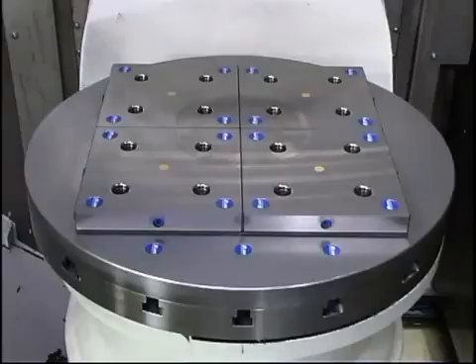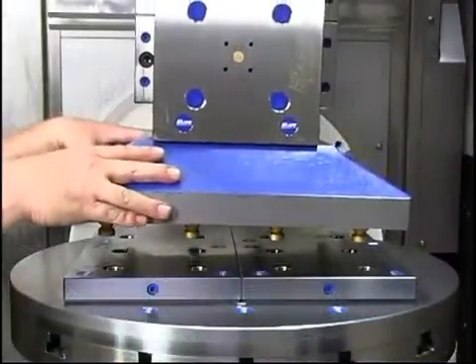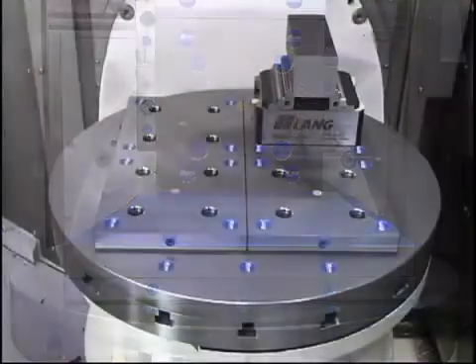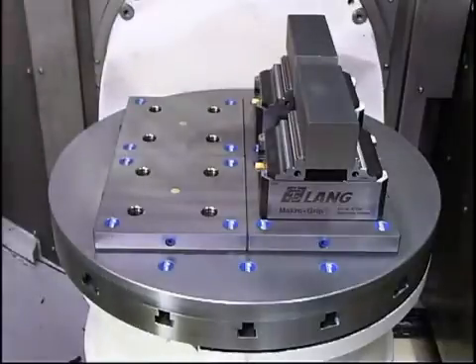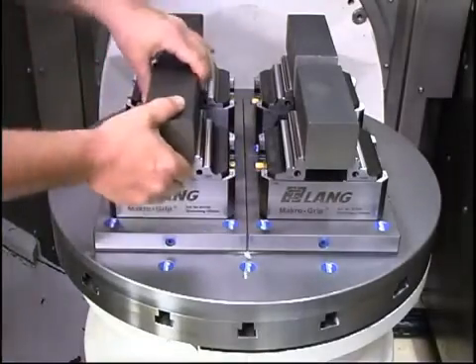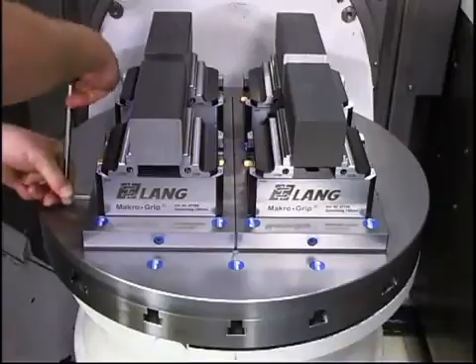By using multiple raster plates in different mounting patterns, this system allows large fixtures to be positioned and clamped without problems. The placement of multiple raster plates on the machine table also allows the highest flexibility in positioning of fixtures at various locations on this grid. The raster plates have no standard mounting bores, allowing custom mounting bore sizes and locations according to the specification of each machine table.